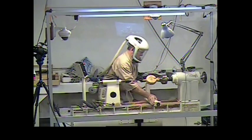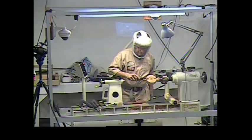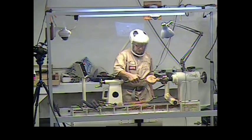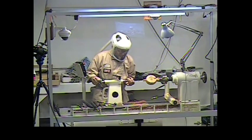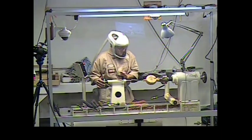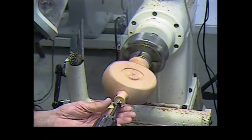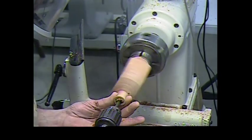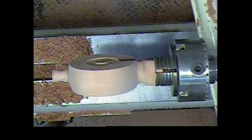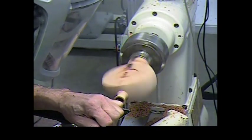I got a 3/4 inch Forstner bit. If you notice, if I take the whole drill in, it goes quite a bit. I need to be at least there, so I need to get about that deep into it. We slow down the drill. So we locked in. Now I want to open this up just a little bit in here. Again, I'm just doing a straight cut.